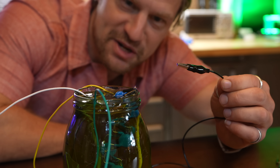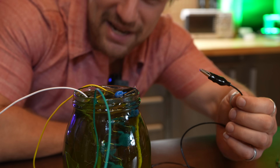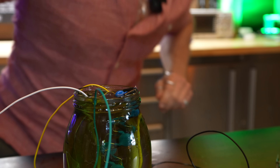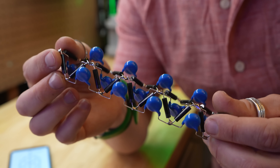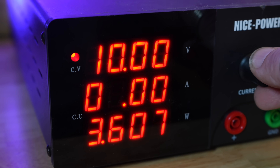As you'd expect, there's an improvement — maybe like an inch and a half. But I need more than an inch and a half. I need sparks at least two inches long per multiplier for this project to work, and this full-wave multiplier still wasn't cutting it. I've used half-wave multipliers for decades — they're great, and even though full-wave multipliers are supposed to develop higher voltages, they require higher input current. If you can't provide that current, these bog down and perform like crap. That's likely the issue I was having, so I set out to build a more forgiving half-wave.